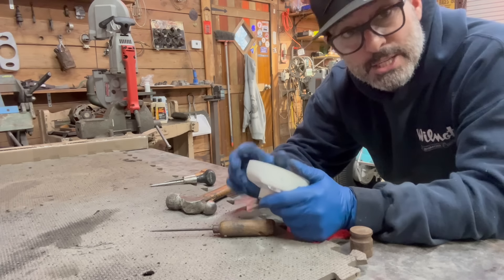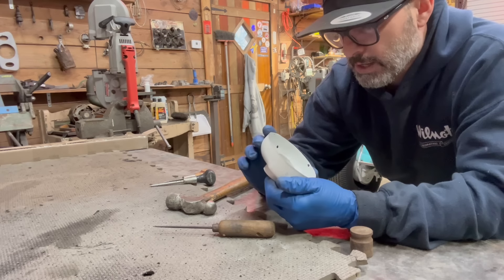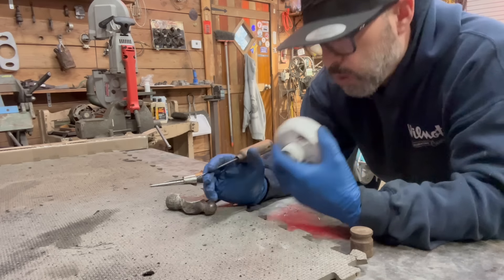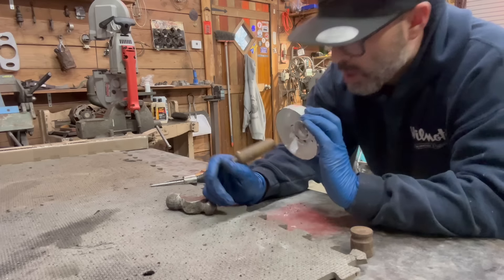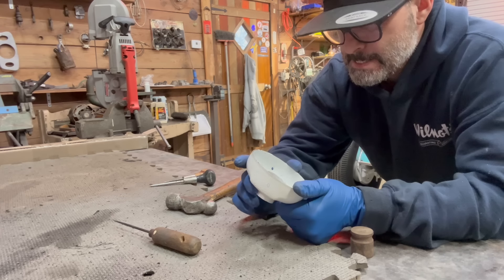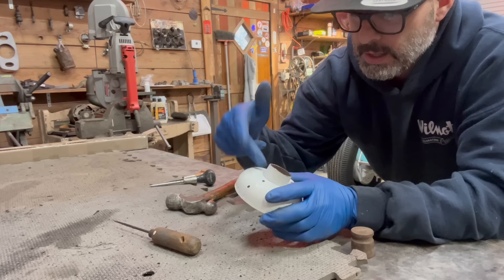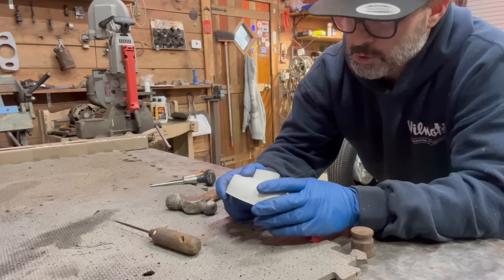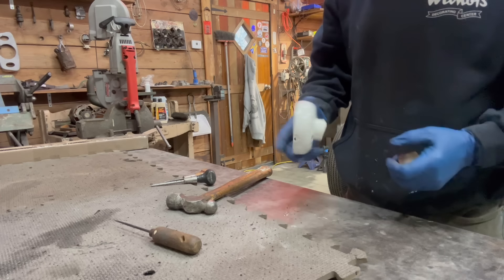There's bearings in there — that's interesting. I did not know that, but it makes perfect sense. So there's a bearing and there's another lip around it — that is the outer race for the bearing. That means I need to get the bell off of this tube and then cut the outer wall of the tube itself, unless that bearing will move.